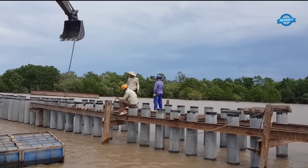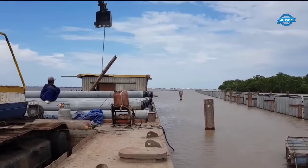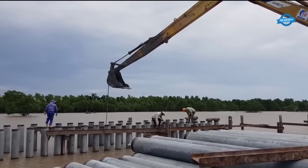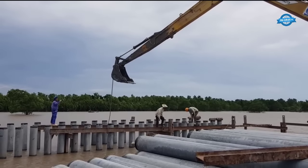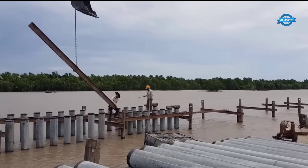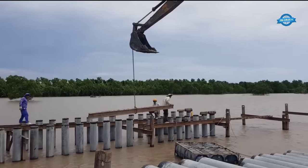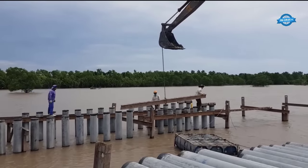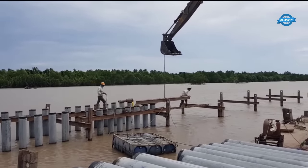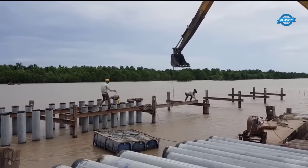The Mui Ran Coastal Protection Embankment Project in An Bien spans a length of 5,000 meters and is currently being implemented. Through pile driving and embankment construction, this project aims to protect the coastline from erosion and provide favorable conditions for the livelihoods and lives of people in the area. The process of constructing BTCT D300 pipe piles is an essential part of building the coastal protection embankment, contributing to the safety and sustainability of the coastal infrastructure and environment in the region.